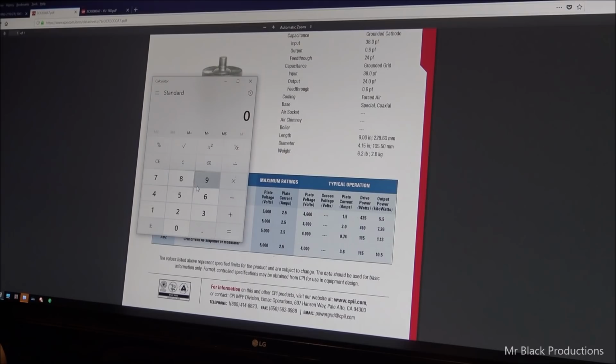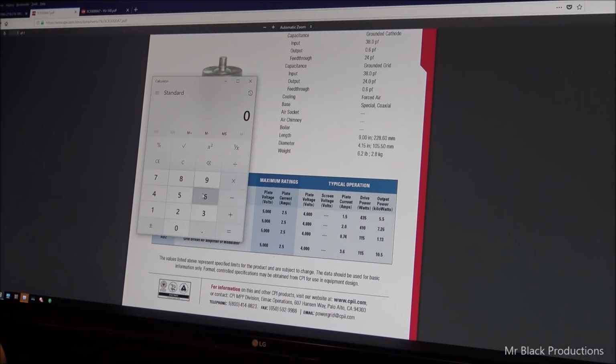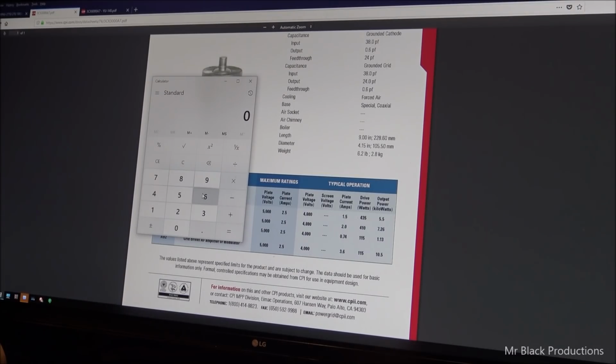And anyhow, let's get back around to specking out this transformer. So, we know that we're going to have a sag, and that's because the power supply is unregulated. We know the other part of that is that the power supply is too small. You're applying too big of a load to too small of a transformer, and the transformer isn't able to sufficiently keep the amperage output, and the voltage output of the transformer is not able to supply what you're putting upon it. Okay. Those are the things that cause us to have voltage sag.